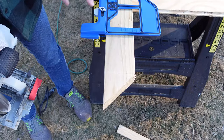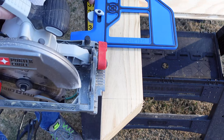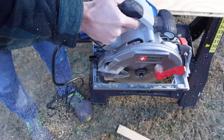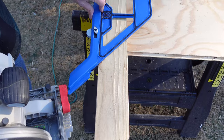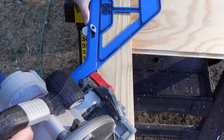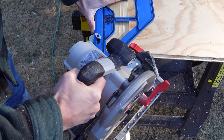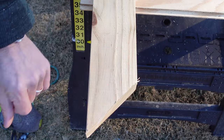Let's head outside and make some cuts — just a couple of quick cuts to demonstrate the tool. First, with the 90 degree portion of the crosscut, put it right up against the 2x4, line up the shoe on the edge, and fire it up. It goes right through nice and easy, and a real straight cut. On the 45 degree side, same thing — put the edge of the crosscut right on the 2x4, put the shoe on the edge of the crosscut, and push it through. You always get a little more resistance with a 45 degree angle cut on a 2x4, but that is a straight cut. It really came out nice.